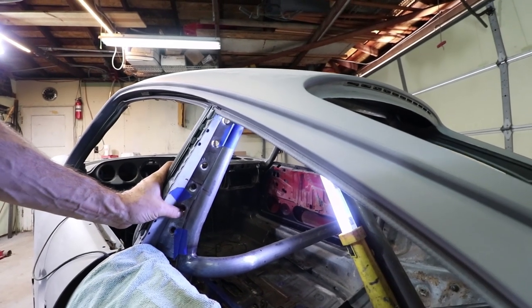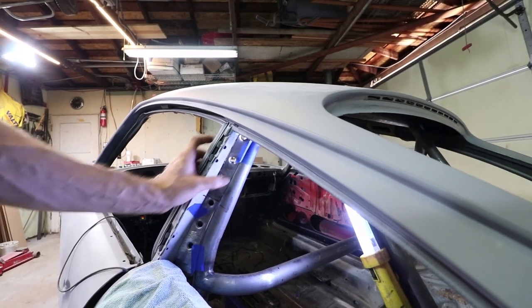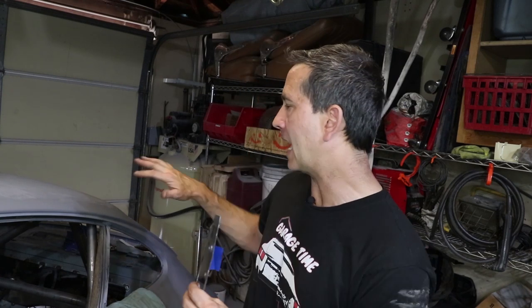If I squeeze it in there, all the gaps go to about zero, which is perfect for welding — it just needs to be pushed and welded. I've trimmed the other side and copied the holes from this part to the passenger side. It's too early to weld it in right now: one, because I need to check the seatbelt fit, and two, I'm not finished working on the rear of the car. The last thing I want to do is weld the roll bar in before I've had a chance to clean and prep for paint. So even though it's tempting to just burn these in, I don't want to do it too soon. But it is helpful to have them made and cross it off the list.